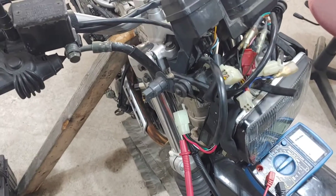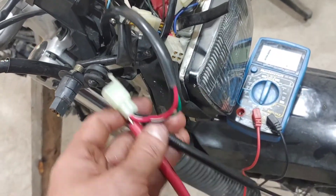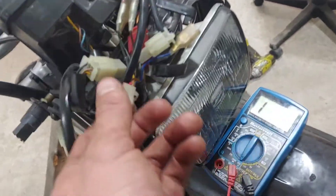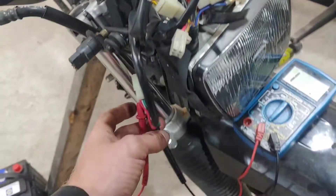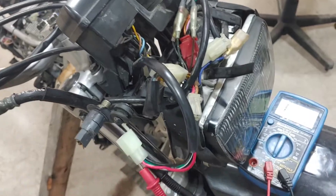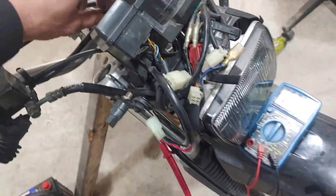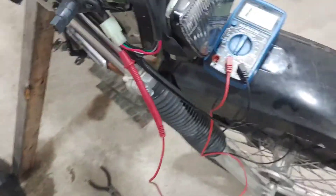Here's the connector for the switch. When you turn your switch, it's gonna connect the black and red wire together, which basically turns on power to the bike — your light will come on. On the bike side, that's actually a brown and red. The switch also has a green and black with a white wire, but on the bike side it's blue and blue with white — that wire is also supposed to connect those two wires together.